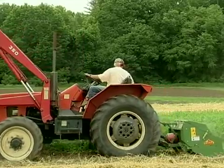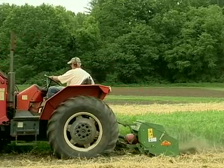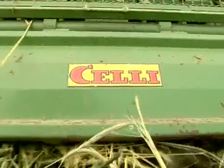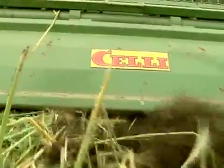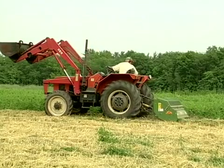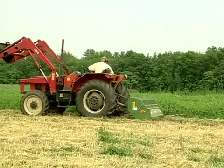These operate at slow speed, so one disadvantage is that when you're bringing that organic matter into the soil I can't move very fast because it's a lot of biomass chopping in there. But once it's in the ground and I've made a couple of passes, then I can go in with a field cultivator and do a very rapid pass, make a nice smooth seedbed, and then I'm ready to go.